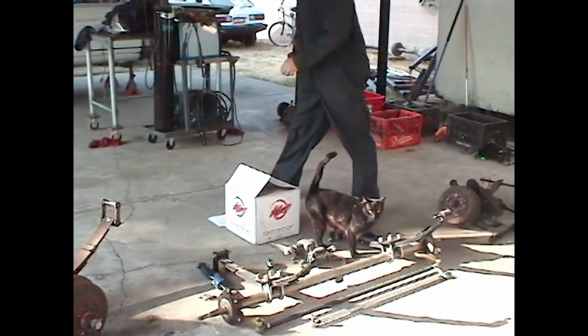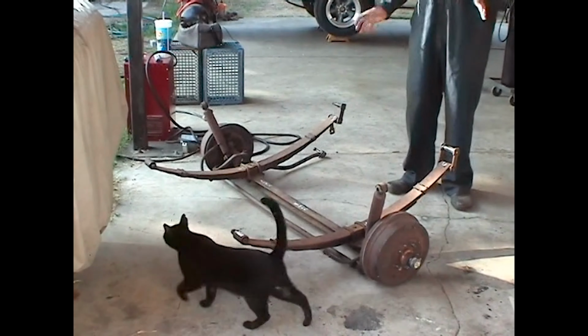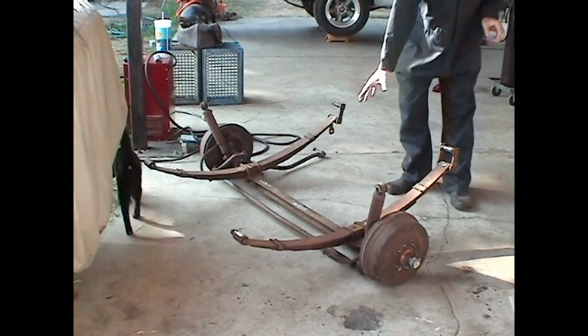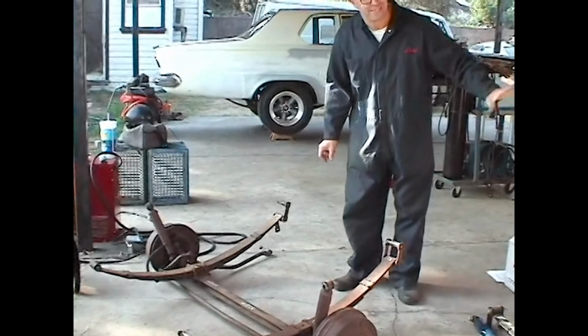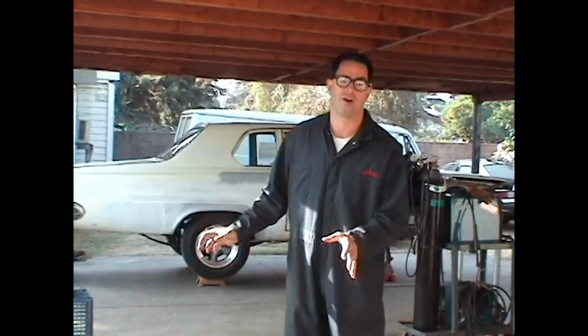or you can go to the junkyard. This is a Dodge A100 van straight axle. Now, these are not light, 223 pounds versus about 156 for the tubular steel axle, but this is a classic piece of funny car history. In fact, the Little Red Wagon, Landy's 64 Dodge, the Mr. Norm 65 supercharged 165-mile-an-hour match racer, they all used this very same axle, as did the Kid Goat and Rampage Dodge Dart. So there's a historical precedent for this axle.